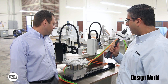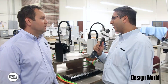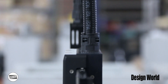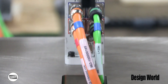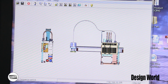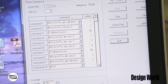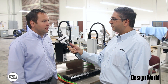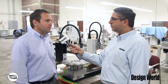So this is running one program now. Can it run others as well? Each one of the HP-70s can go up to 325 millimeters of horizontal stroke, up to 70 millimeters of vertical stroke, with infinite positions in between. Our software that we offer is our Weiss Application Software — WASS. Extremely user-friendly. I'm not a controls person and I can program this thing in five minutes to do what it needs to do. Extremely flexible — change it on the fly. A lot of options, a lot of things can be done with this HP-70.